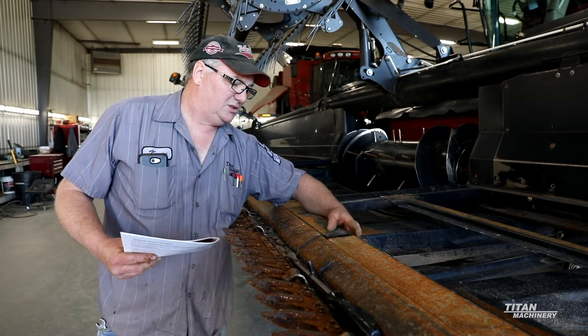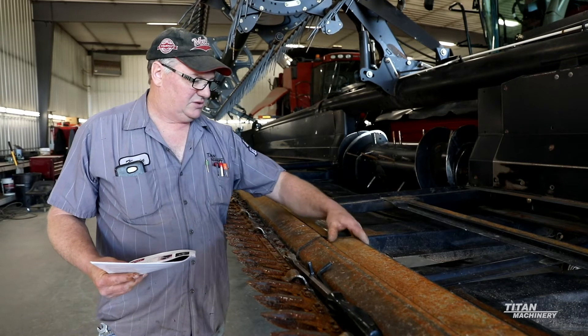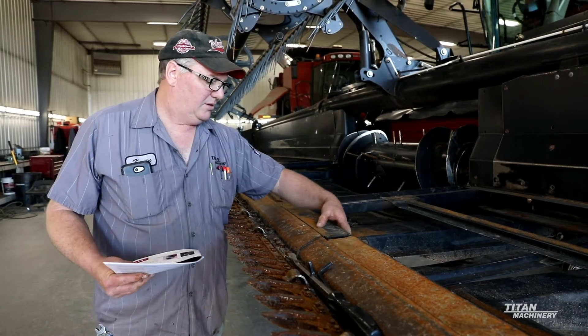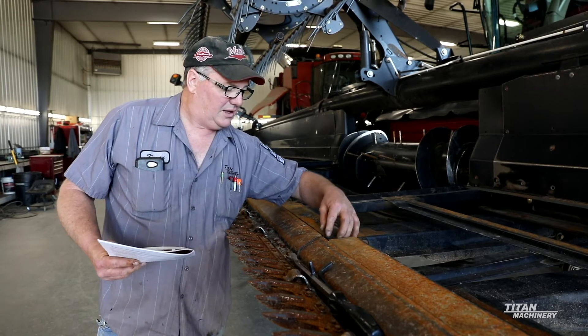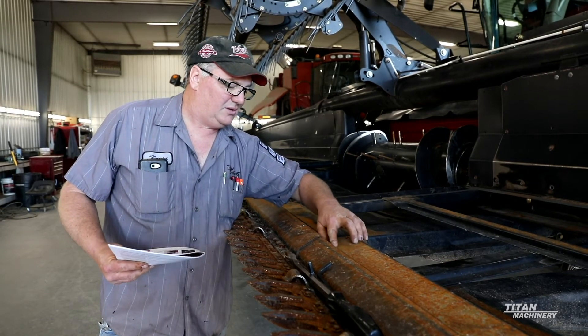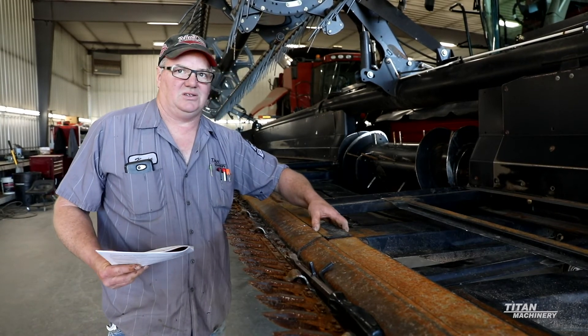You'll end up with one of these extra braces to be put in on the older heads to support the deck plate - it just involves some welding and cutting. As you can see, this one has the new kit. I know a lot of the 2162s and FD70s are starting to wear out down in here. Also, I have seen on the FD75s with the new kit some cracking on this deck plate, so you do want to get in there and inspect that if you have an FD75.